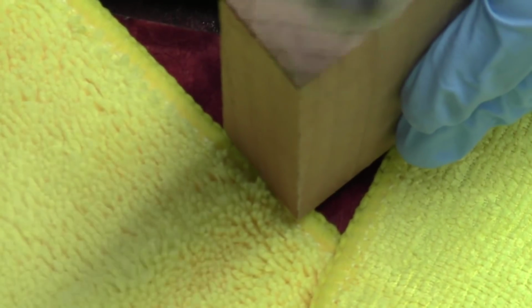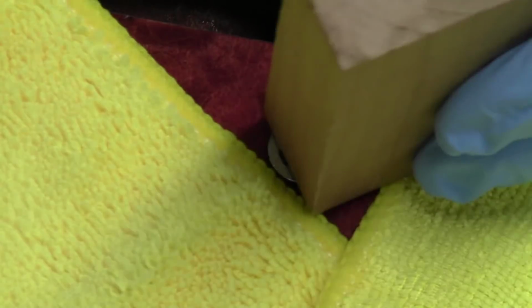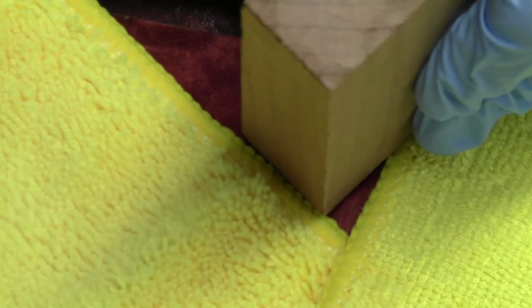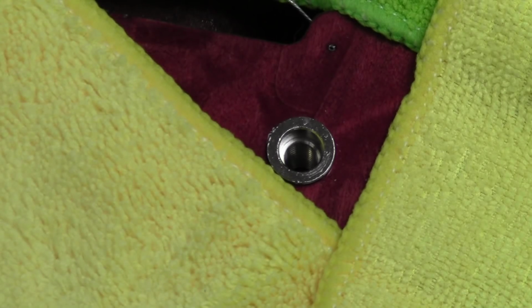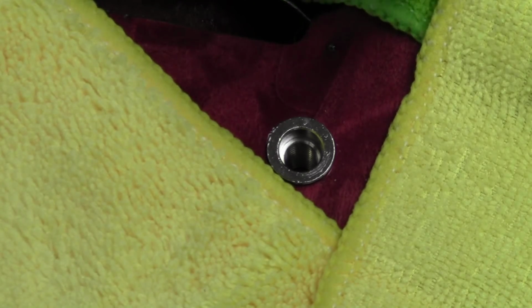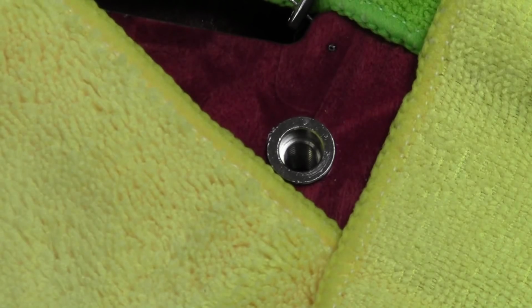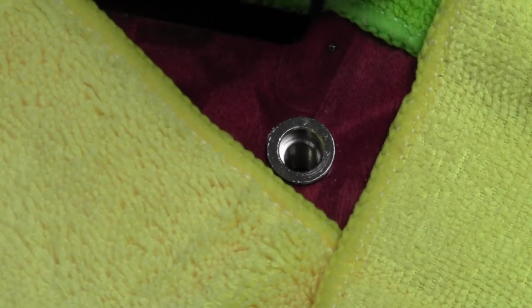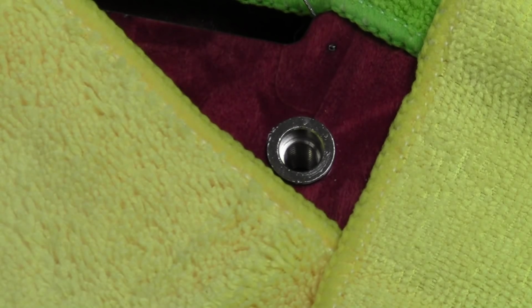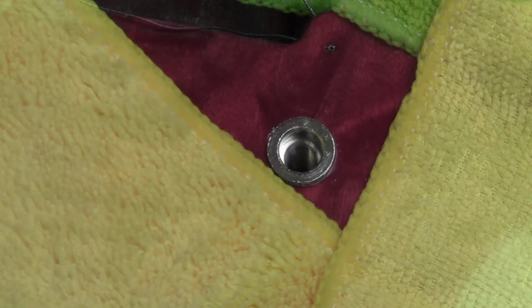So it's pushing against that ground wire right now. So it's grounded. It's fully grounded. I'm going to grab my multimeter real fast so you can tell this. There's a clip here. Right there. And then this is electrically connected. So that is done. The bridge is fully grounded, way back here.